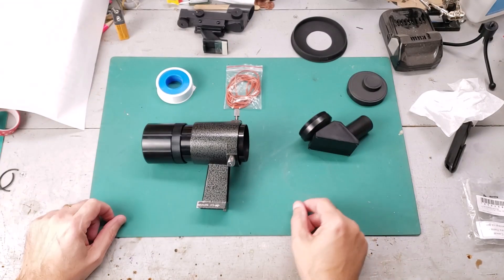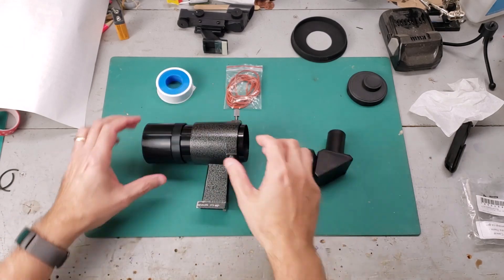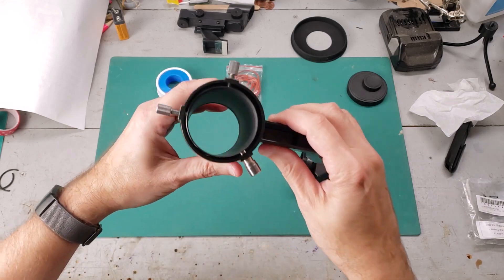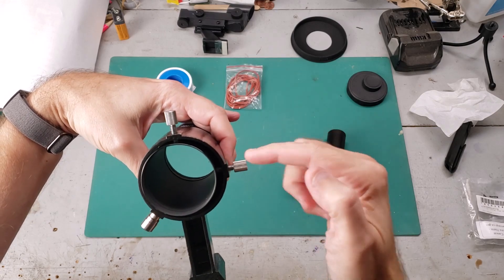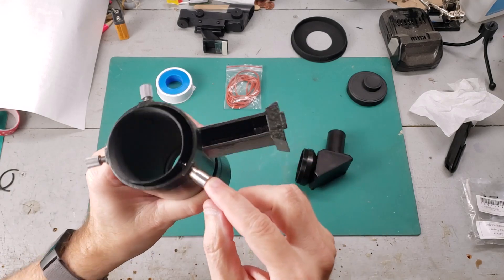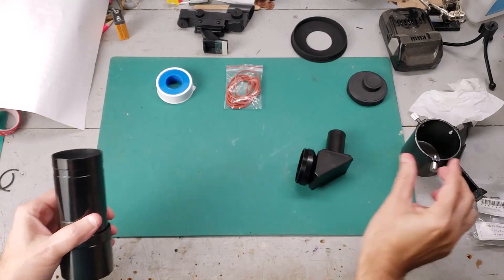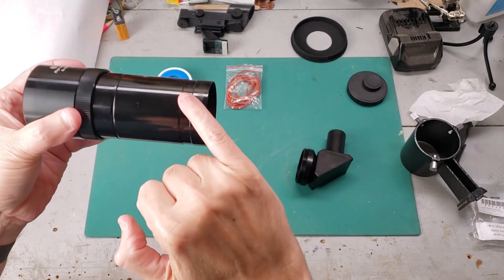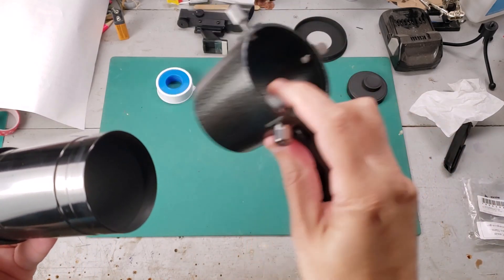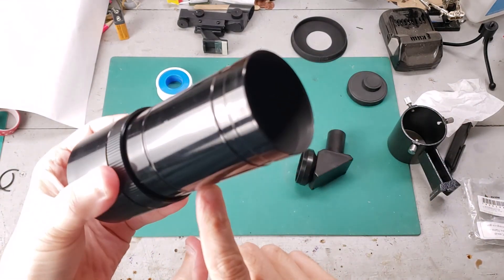Okay, so we have two problems here. First, we have to figure out how to make these threads grab on the back, and we have to pull this out and figure out this O-ring. It has an interesting mount with two threaded screws — this one controls right to left, and this controls up and down adjustment. This third one looks like a screw, but it's actually just spring-loaded, and its sole purpose is to keep this from falling out. We've got a little groove right here where the spring-loaded element grabs it, and we also have this little groove up here. It's about the size of an O-ring — because an O-ring goes in there.